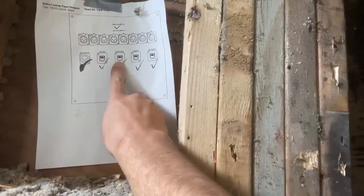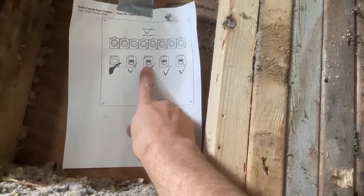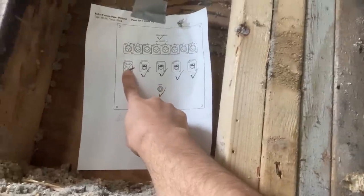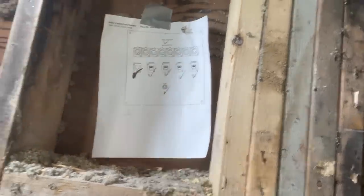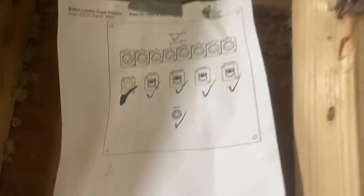So you can see on here, there are eight actual audio tie lines. That's going to be the Mogami cable. I pulled a bunch of Mogami out of Barefoot that I'm using here. There's going to be one line that sends signal into this space from the control room. This is going to be a male connector, so the genders will work right. This is mostly for if I'm doing my guitar reamping thing, then I can be playing in the control room through a DI and have that signal get fed out into this booth and then go to an amp. If it's a combo amp, I can put the whole amp in here and feed to a reamp right here through that connection.